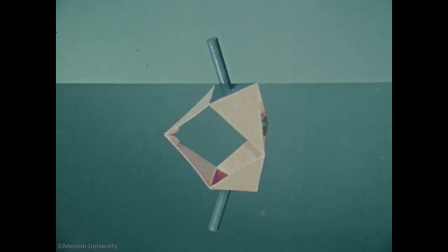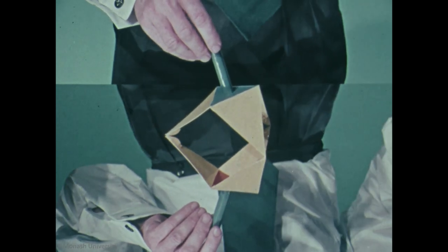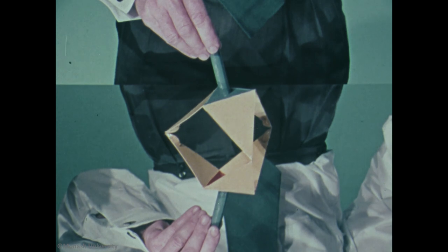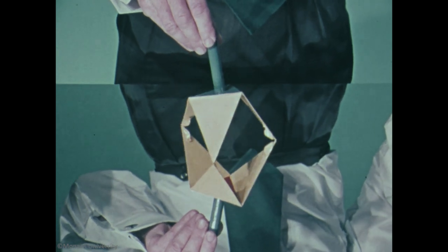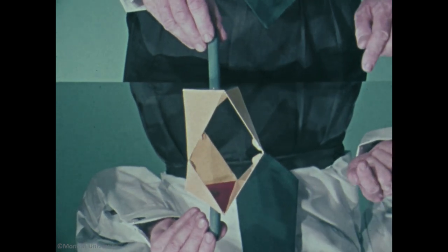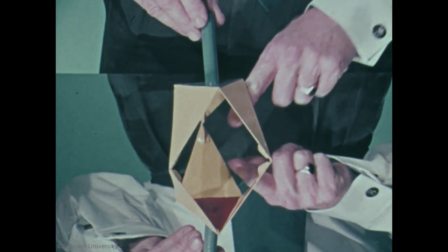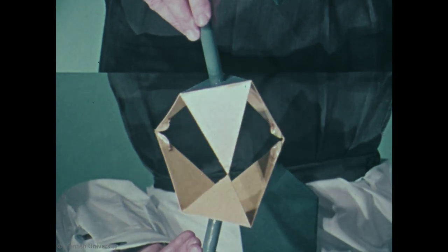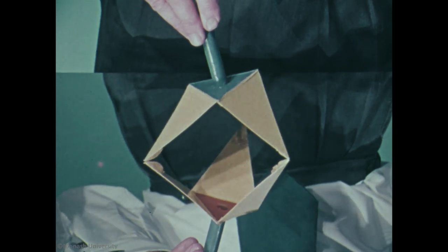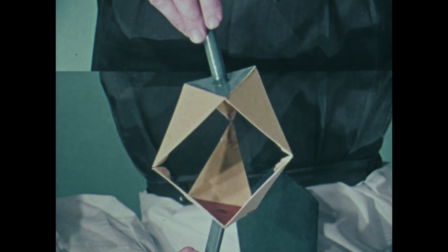As an introduction to constant velocity couplings with exact symmetry, here is a cardboard tripod standing on a mirror, looking like two tripods joined together at their feet. However the tripod stands, it's always symmetrical with its reflection. The axes of the two shafts, one attached to each tripod, must always meet at a point in the mirror plane at the geometrical center of the coupling. The theory establishes that for a single coupling to transmit uniform speed, the shafts must intersect at this point. The tripod is, of course, self-supporting.